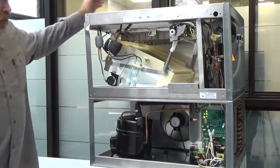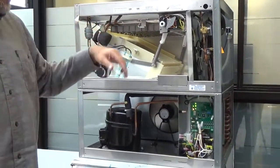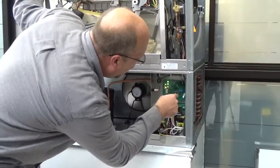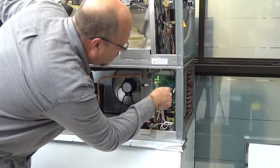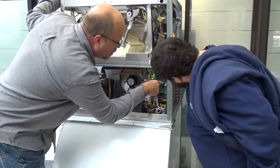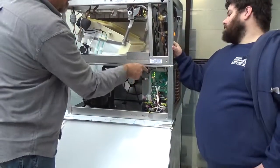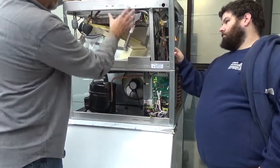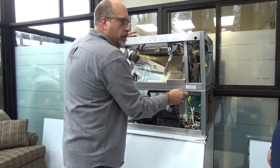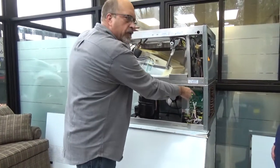If you get a new control board, the instructions will tell you if you have a dual evap. On this jumper, full rinse and dual evap, there are little covers. On the full rinse one, there's one on it. The dual one, there's not. The only time you have a dual one is when you have a 1064. When we send the boards out, they don't know which machine it's going to, so they always send them with both of those on there.